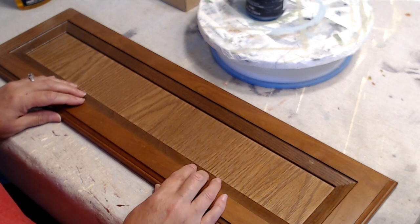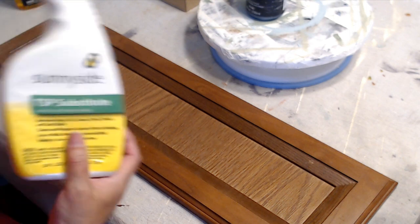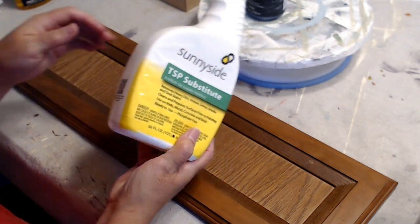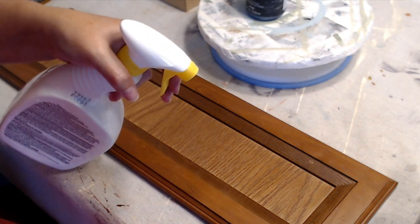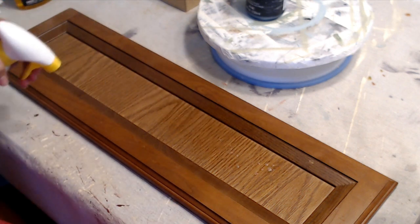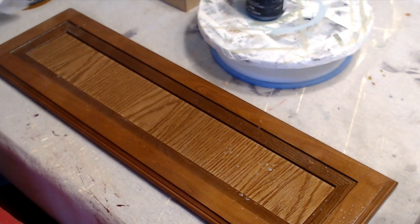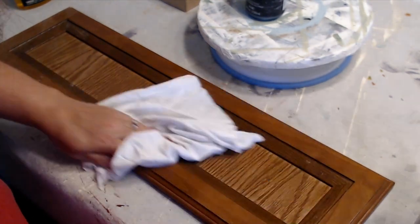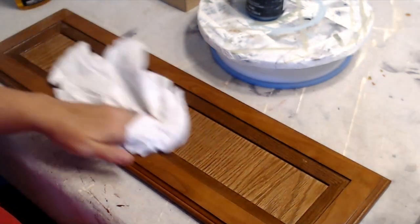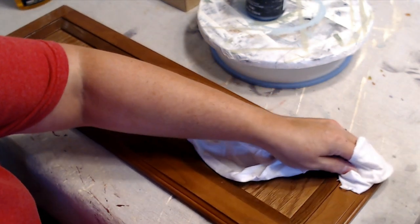Now the first thing you want to do, whether it's a brand new cabinet door like this was or an old one, is you want to clean it. And I'm using this TSP substitute, and I'll leave you the link below. I'm going to just spray it onto my cabinet door, and then rub it down really well using a soft, clean cloth. And this will just ensure that any grime or grease or dirt that's been on here is completely cleaned off, so it does not affect your paint job.